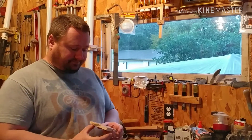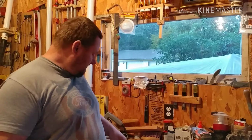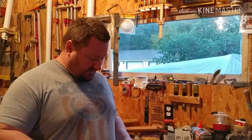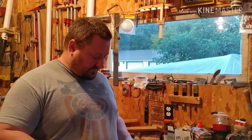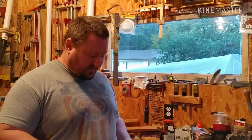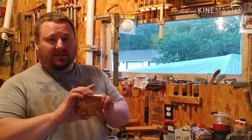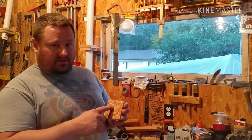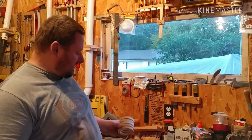Now all I did is took a 3.5 inch square, made some circles on it. The first circle, the center circle where the can's going to sit, I made a little bit smaller than the can. It's at 2 3/8. The larger outside of the koozie is 3.5. Then I found center of this, or just drilled a hole in here, took my scroll saw, scrolled out the center, scrolled off the outsides, and I wound up with a bunch of these.